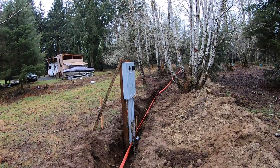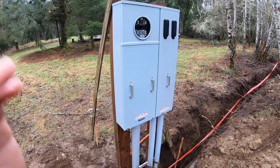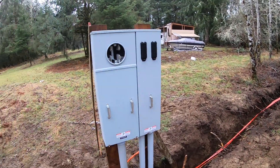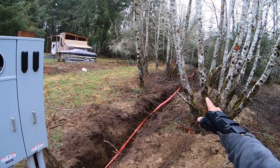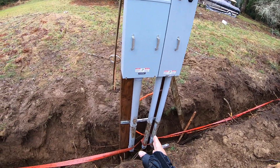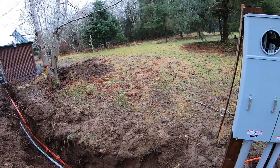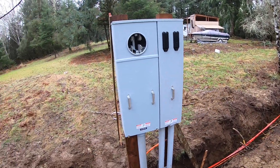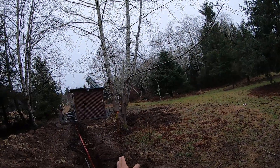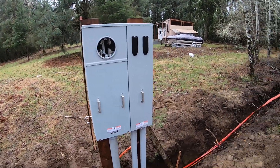It is January, pretty normal. We're putting the meter in the trench on these posts. The county will only run a maximum of 185 feet from any transformer, and this is 160 feet to this point. To the utility shed where we're going to put the septic controls, that's about 205 feet, so we just brought it here to keep it away from that tree and this tree, so we can push those trees over and take care of them later without messing up the panel.